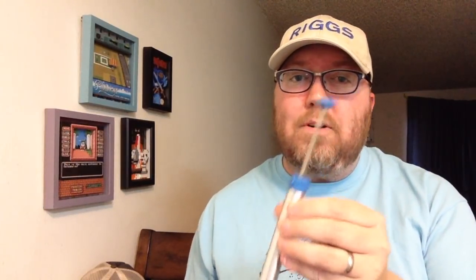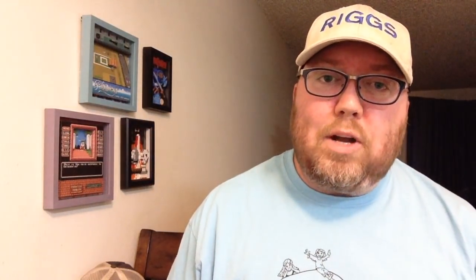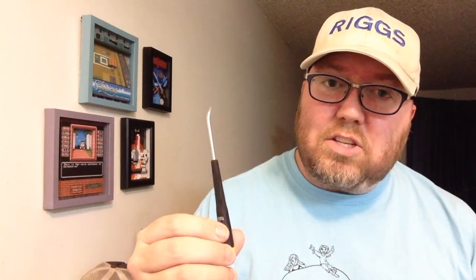This is more like if you're going to do this a lot. And you may have seen these solder sucker pump tools before — you heat up the solder, compress it, push it over, push the button, and it sucks up the solder. I would not recommend this; this thing is a pain. After you use something like the bulb or the Hakko, this thing is pretty much worthless. If you're unsoldering EPROMs, an EPROM remover comes in handy. You don't want to use a screwdriver — it might scratch up the circuit board and cause serious damage. You just barely pop it in there. There's also a little clipper thing that grabs both sides and picks it up, and that works wonderfully too.